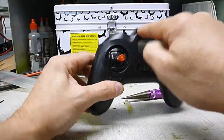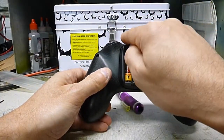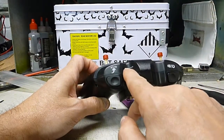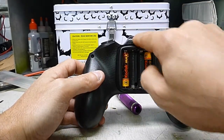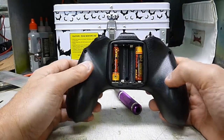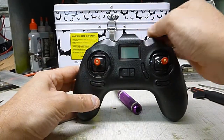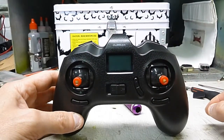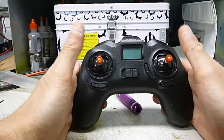Under the board in the top there'll be the antenna laying sideways. You can just pull that out, use a reamer to drill a little hole, then feed the 2.4 antenna through and push the rest of the antenna back in the same position it was when you opened it up. Then just extend it out like that — maybe that little bit out will give you more range. I know it does on little quads I did before, so if you want to try this, try it out and see what happens.